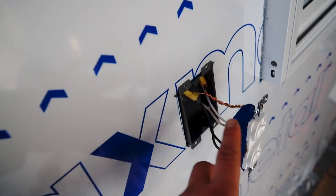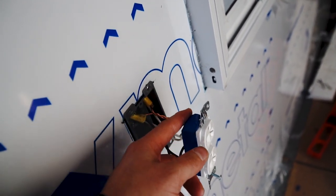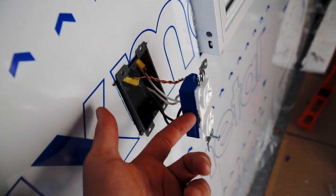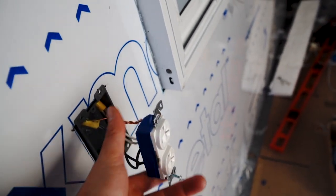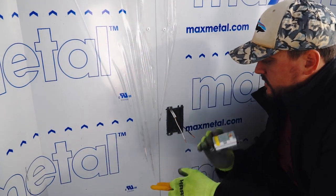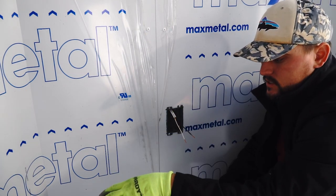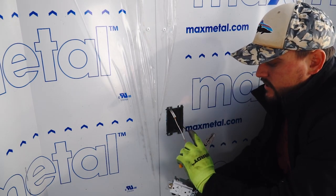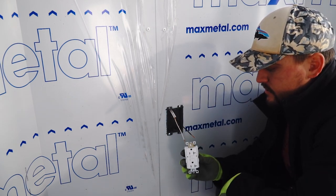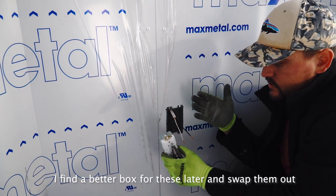Because I'm squeezing this into such a tight box, I'm wrapping the wires a couple times in electrical tape. That'll prevent me from shorting this out by the ground touching my hot wire, which would trip your breaker - that's why you see electricians do this. For this outlet behind my three-compartment sink and hand-washing sink - where my water pump will plug in and the water heater and fresh water tank will be nearby - I'm going to use a GFCI-protected outlet for added protection. The only issue is this outlet is an inch and a quarter deep and I'm using a one-inch deep box.